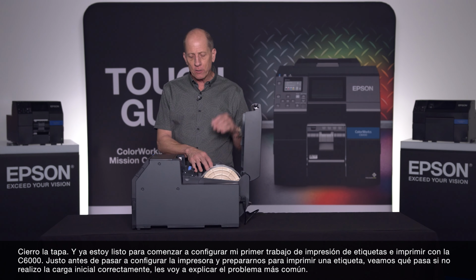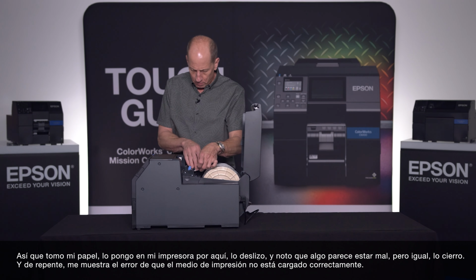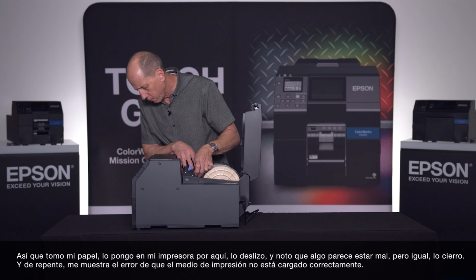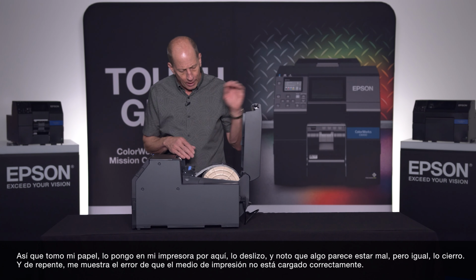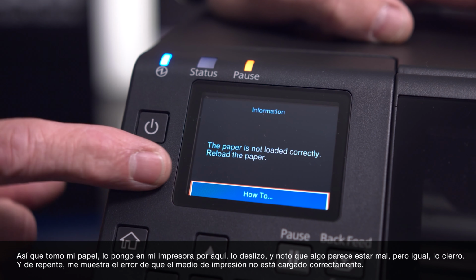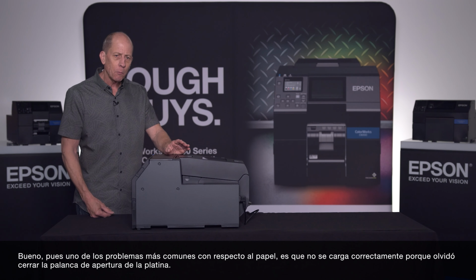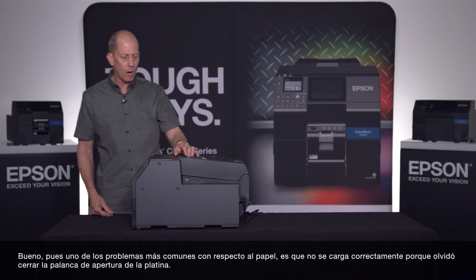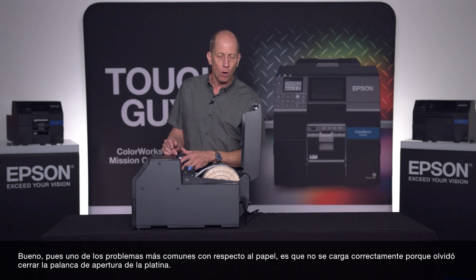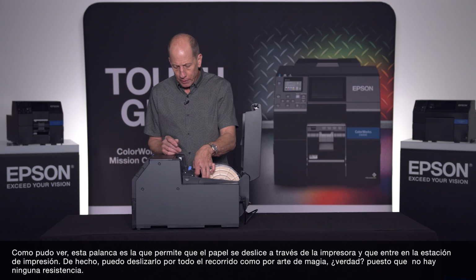Just before we move on to setting up the printer and getting ready to actually print a label, let's just see what happens if I don't do the media loading properly, and I'm going to talk about the most common symptoms. So I take my media, I put it into my printer here, I slide it in, you know, something doesn't quite seem to be right, I shut it, and all of a sudden I will get the error that the print media is not loaded properly, okay? One of the most common problems with the media not being loaded properly is that I forgot to shut the platen open lever, okay?